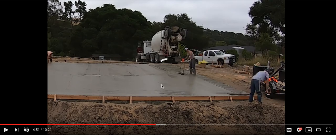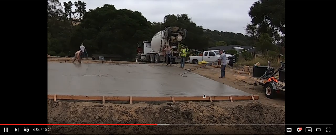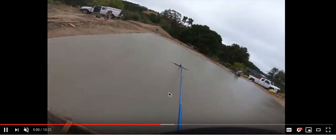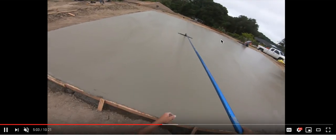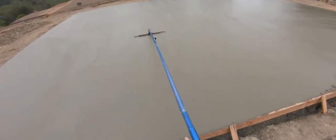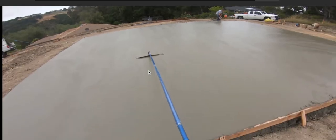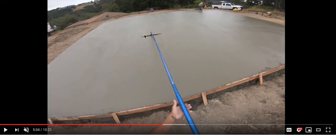So, bleed water — you want your bleed water to be gone before you put any steel trowels on it. You can get on top of it with a mag before bleed water — that's not an issue. Your magnesiums, you're okay. The steel trowels, though — this is where you're creating a coating, sealing it off. The evaporation is going to be from the top and coming from the bottom, and you're going to create a dry plane where it won't make its way through this top surface because you're still troweling too soon. I'm not saying he's troweling too soon here — I'm just letting guys know, because it's a time-lapse and I don't know if there's bleed water there.